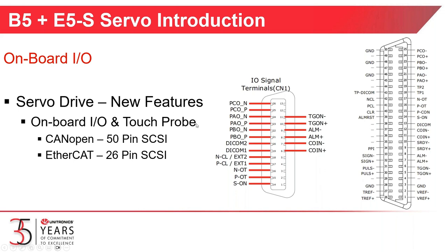The touch probe feature can be thought of as end-of-stroke external sensors. If you have your motor hooked up to a ball screw actuator, you can mount limit switches on the forward and reverse end-of-travel. That can be wired into the IO terminal and it will operate as an end-of-stroke signal to the drive, so the drive will stop or change direction however it's programmed.